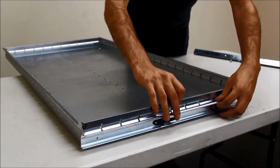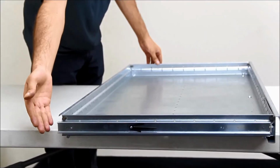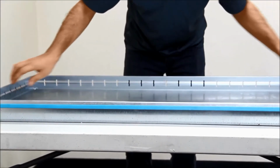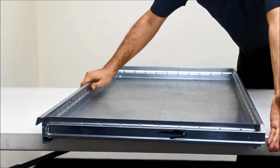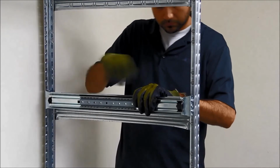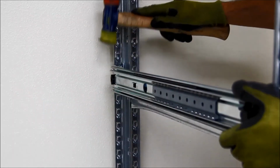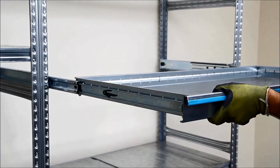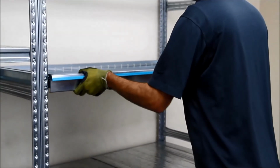Now attach the guide rails with the provided hardware to the drawer. Attach the sliding gliders to the frame and hammer in gently to safeguard its support. Be sure to tighten the bolts on the mounting brackets to the frame in order to prevent any accidental lifting of the drawer. Lastly, simply input the drawer in position with the sliding gliders and insert completely to lock in place.